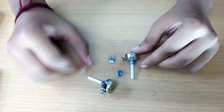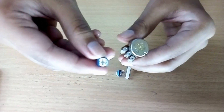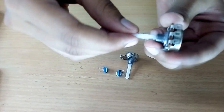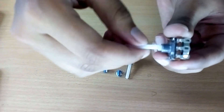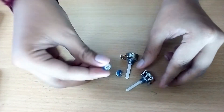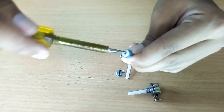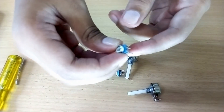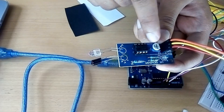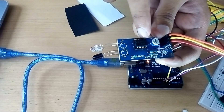The IR module also contains a potentiometer and an LM358 comparator. Here I have two different kinds of potentiometers — a 10k potentiometer and a 5k potentiometer also called a trim pot. They are just variable resistors fitted with three terminals and a rotary control shaft or spindle which can be used to vary the resistance. You can vary the resistance using a screwdriver. These potentiometers are used to give reference voltage to one terminal of the comparator, setting the reference voltage.